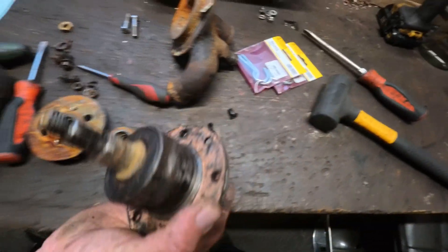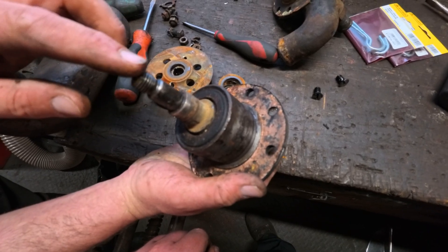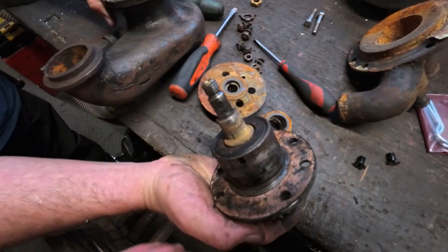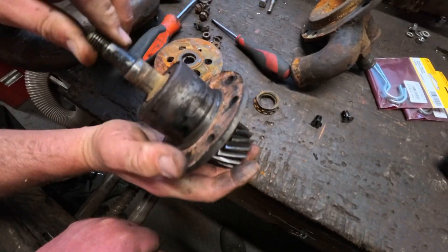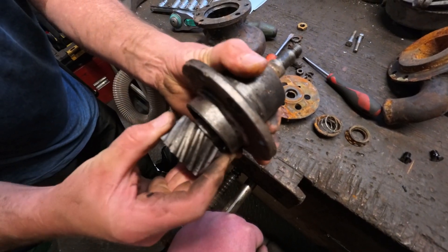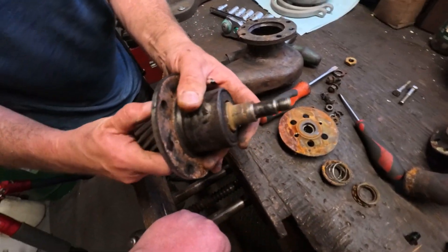That cartridge will have an oil seal in the end - there's an oil seal there. So when you turn that oil seal out, there'll be a circlip under there probably. It's leaking on the oil seal, it's coming out of the telltale. Well, when it's got that much play in it the oil seal isn't going to be doing a lot anyway - it's got play that way, look. You could argue perhaps there wouldn't be as much play once the seal's in place, but there isn't anything stopping it having that much play.